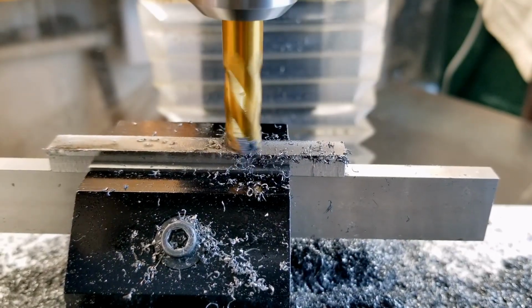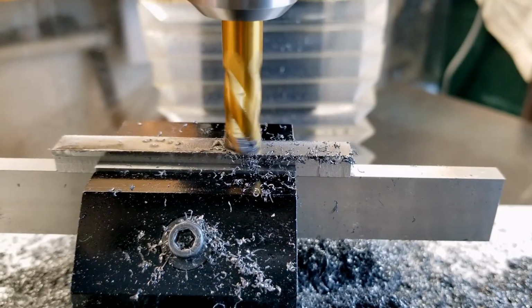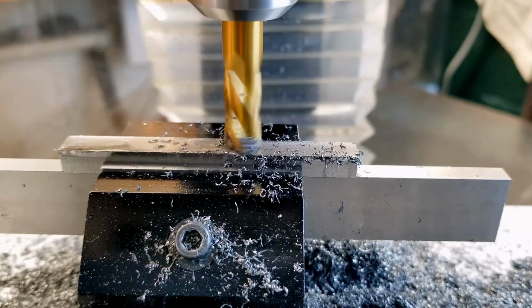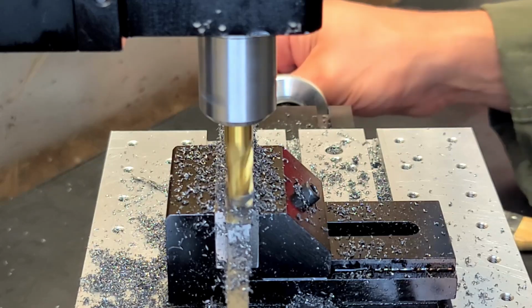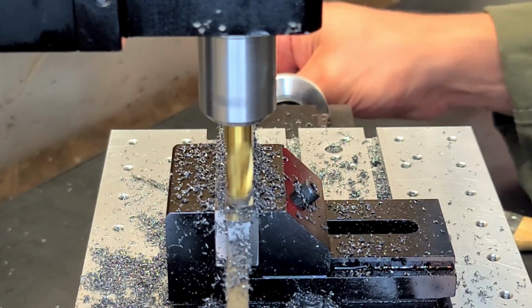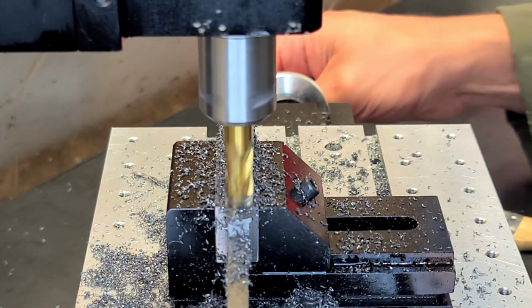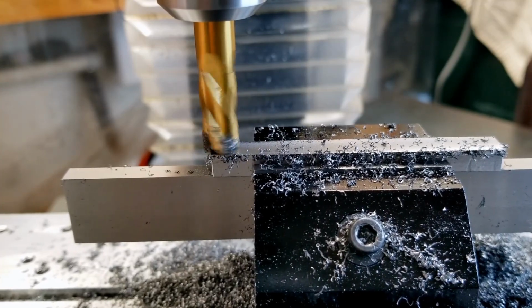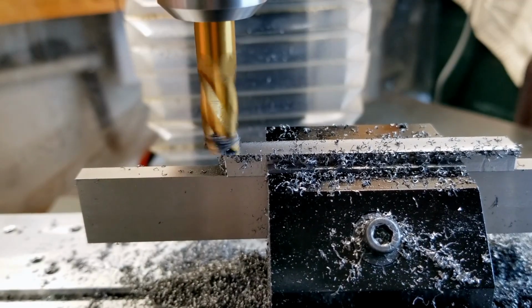on that bearing surface. Even when taking a climbing cut on a finish cut, this setup just did not react well and did not leave a good finish. A little tip here: one of the things I had learned by the time I finished cutting out all these columns was that it was better to reduce the width of the columns to 311 or 312 and then cut the top face, or the bearing surface, of these columns. By doing so at 311 using a 3/8, or 0.375, cutter, I was able to finish the cut in just a single pass.